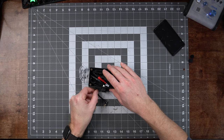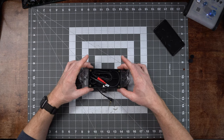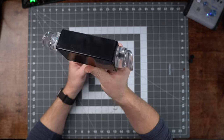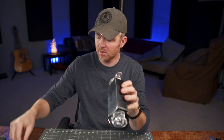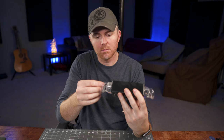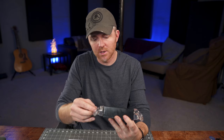You can pull this in and out if you need to, which is nice depending on your camera or where you're mounting this. The next step is to put the back plate on and test this out. At this point you have a working binaural audio microphone setup. But if you want wind resistance, you need to do one or two more steps.